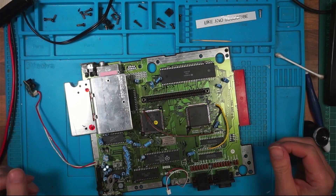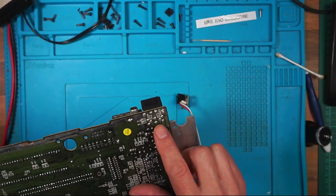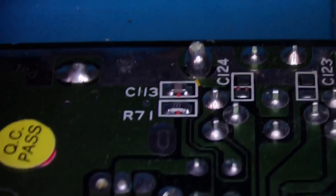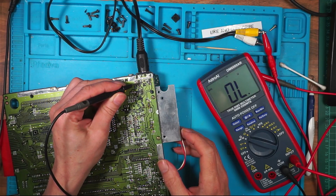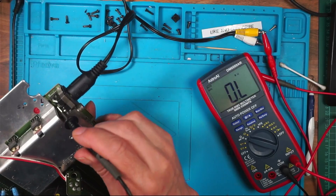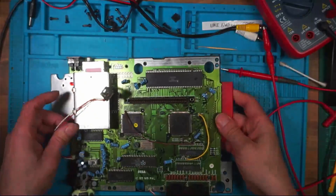I've got contact cleaner splashed over my nice new console. So it's playing the game but nothing on screen. Well it can't be something serious — perhaps a loose pin. I'll have to take that thing apart again. I've opened this up and taken the board out. We'll flip this over and have a look at the pins on the back of the video out connector — they look quite good. Just spotted this — perhaps a little bit of rework done on here. Someone's been in here before. This isn't factory, I don't think.